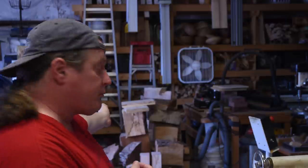I'm also going to be talking about the types of material these machines or tools use. There are machines that can handle green wood — basically stuff straight from the tree, still in a log or a section of a log with bark on it, completely green. The moisture in it affects tools significantly. There are tools that just can't handle green wood. Then you have rough-sawn stuff: a sawmill sections it out and lets it dry — that drying process induces movement and twist. Finally, there's dimensioned lumber — rough wood that's already been straightened, flattened, and smoothed. Some machines require very precise material to operate safely.